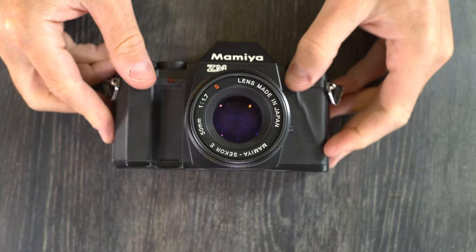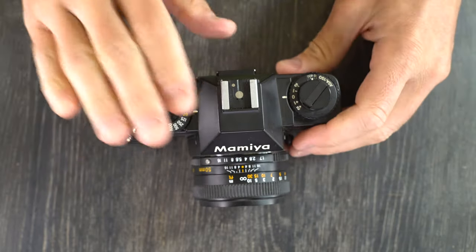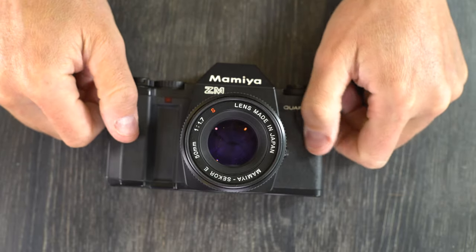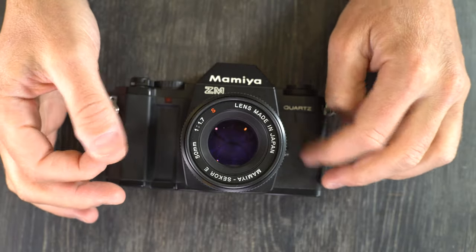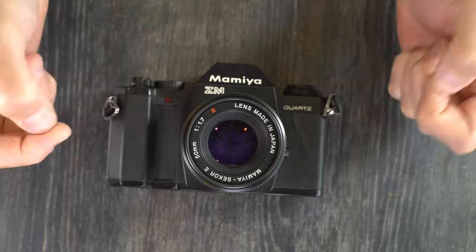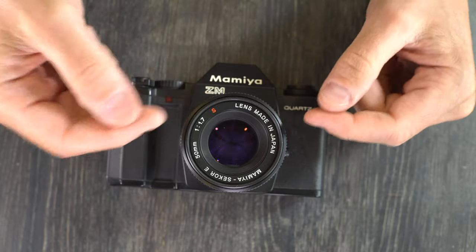Some things not to do with your camera: Don't leave your camera with the shutter ready to fire — always trigger it before you're done, even if it wastes a roll of film. These cameras have mechanical components in the shutters and you don't want to leave tension on those springs as it can weaken them. Don't touch the camera's shutter because your finger oils can cause the shutter leaves not to work properly over time, and pushing on the shutter leaves can cause them to skip their rails and jam the shutter. Don't touch the mirror behind the lens because your finger oils can desilver the mirror, impairing your ability to meter and focus.